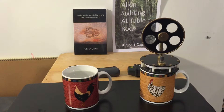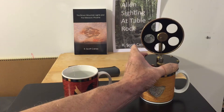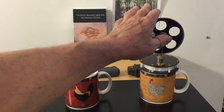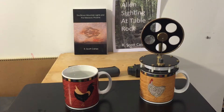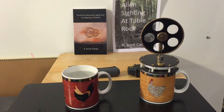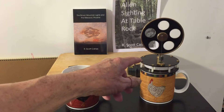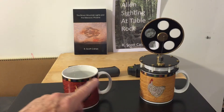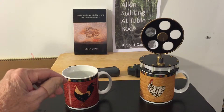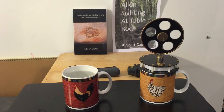I had to give the Stirling engine a little bit of time for the heat transfer surface on the bottom to cool off. As you can see, it's now sitting on the cold water cup and turning in the counterclockwise direction — before it was turning clockwise. The top surface is now warm relative to the bottom, whereas over the hot water cup the top was cool relative to the bottom.